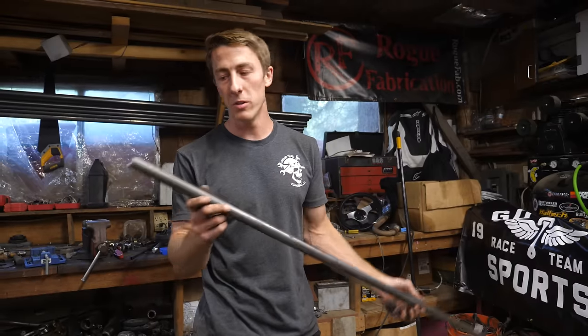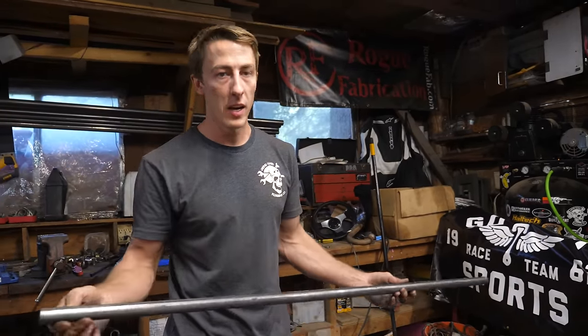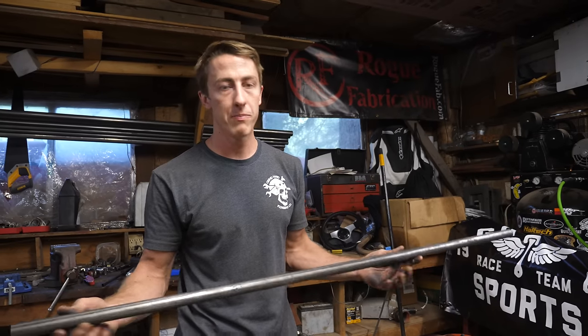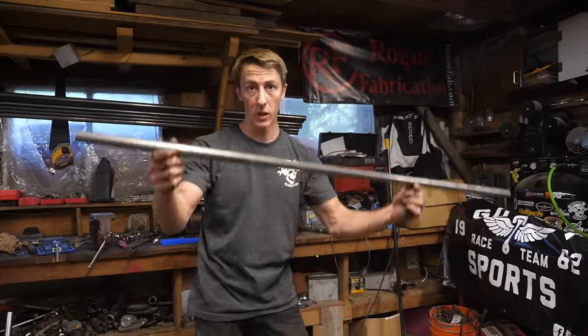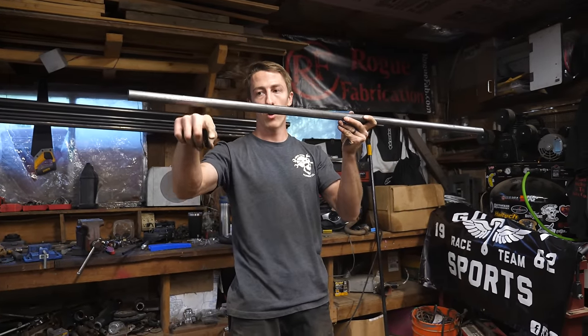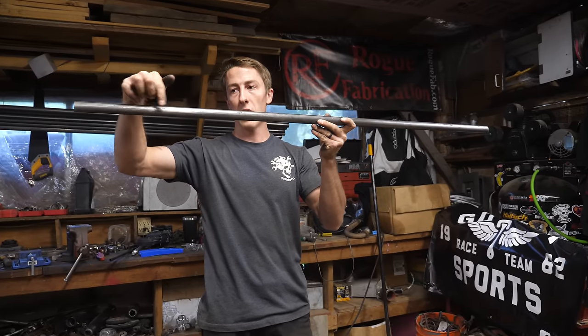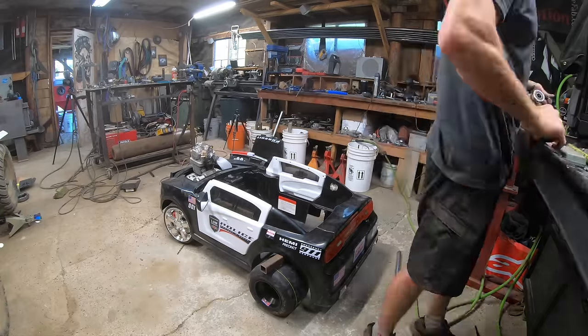The tubing we're using is 1 inch in diameter and 0.083 on the thickness, and we're not going to use the tubing bender at all. That's kind of why I decided to tack it onto the back and then either go with a little bit of a slant or go straight and then reinforce it with a crossbar, because cutting a 45 to tie in is pretty easy and it just reduces having to bend it.